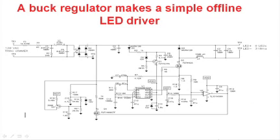Some of the other things you can see in the circuit: our buck regulator, our control IC that provides the PWM signals to the buck regulator. This little bit of circuitry here is a linear power supply, and it just converts the DC input voltage down to a voltage usable by our control IC. This circuit actually generates a constant current through this resistor here, and that current powers our control circuitry.